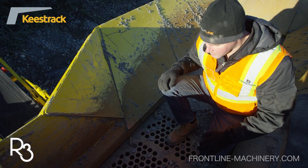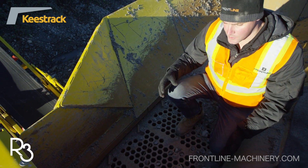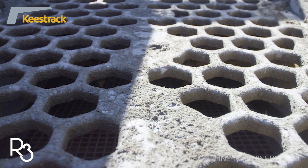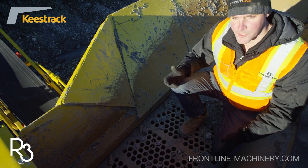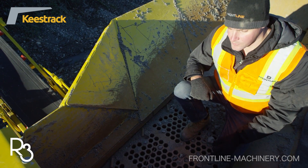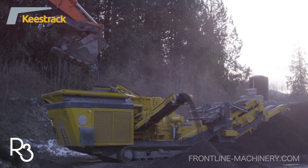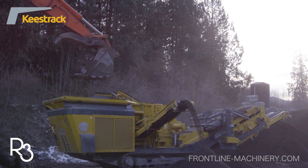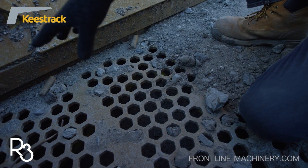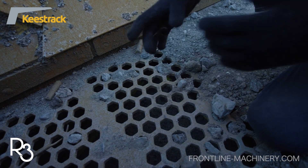The other thing we're looking at here is the pre-screen area of the feeder. This is a punch plate pre-screen that can easily be swapped for various sizes. In this particular machine we've got a 40 millimeter opening, which is a very popular size. But we can go up to a 3 inch, 75 millimeter opening, or we can run a completely blanketed-off area if we're crushing everything down to three-eighths minus. Underneath the wear liners, the entire hopper frame is manufactured from AR450 as well. The feed floor vibrates independently from the hopper sidewalls, which helps break up the material and release it for a good flow into the pre-screen area.